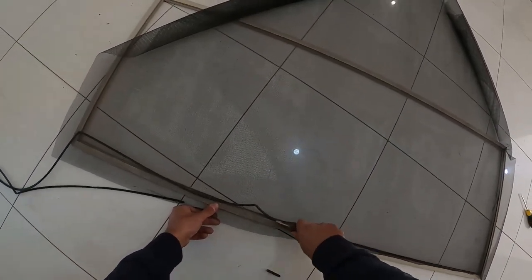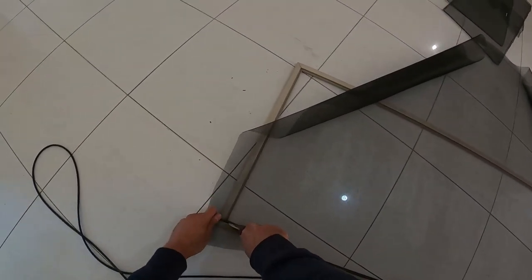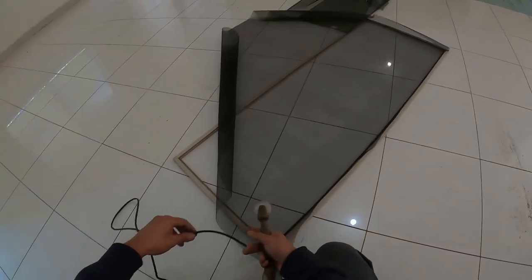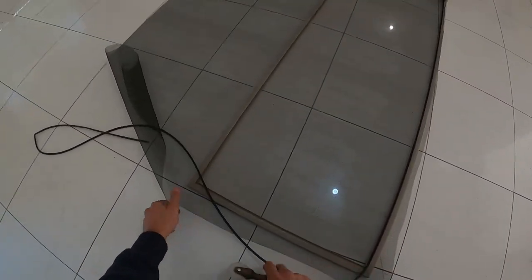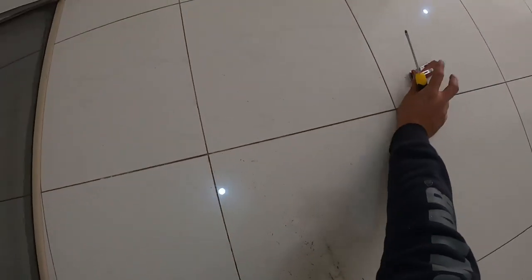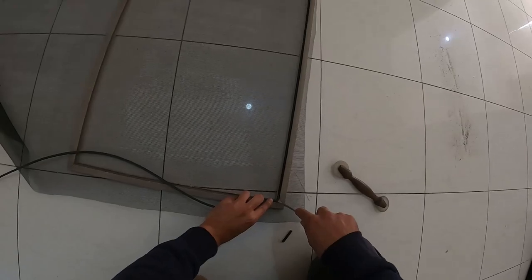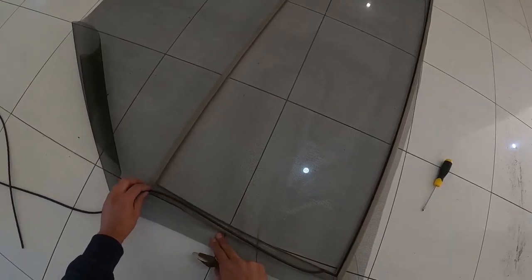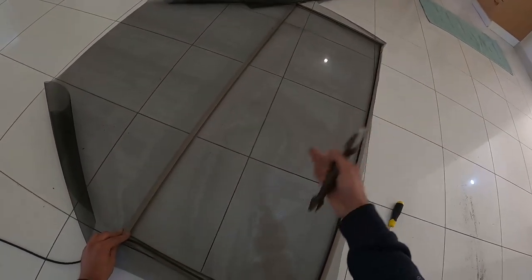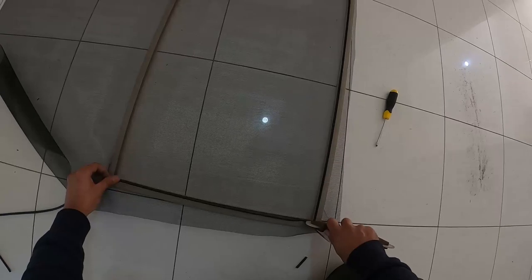We are using the same spline, however when we get to the end you're going to find we'll have a bit of overhang. The reason is we've put tension back on the rubber or PVC spline and stretched it out just a little bit — we can trim that off. Make sure from the start you've got everything nice and flat. If you roll it on a bit of an angle you're going to find crease marks all through your fly screen, so keep it flat and roll that one there out as well.